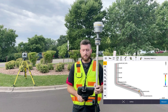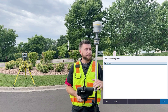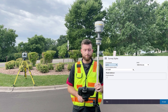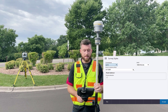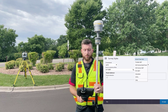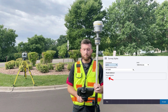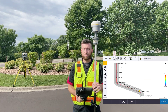First things first, let's take a look at our data collector. We need to have a survey style set up. I have one called SX12 Integrated. When I open up and edit the survey style we have conventional and GNSS, so we just need to establish two survey styles — one conventional, one GNSS — and we're combining them into this integrated survey style. We have our prism-to-antenna offset, and depending on the type of receiver and prism you're using, you'll appropriately select from this list to get that prism-to-antenna height offset. Most importantly for this Tech Talk, we're going to be talking about the Precise Elevation checkbox — we want to have that on. Let's hit Accept, store, and escape out of our survey styles.